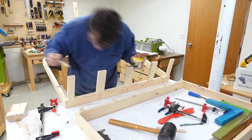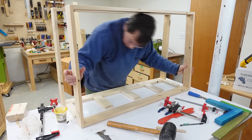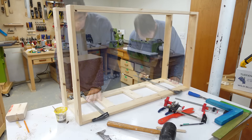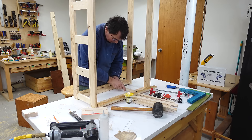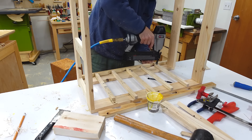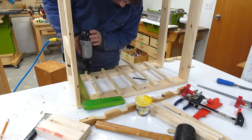There's still sawdust in that mortise and now I got glue in it too. Now it's another one of those times where I have to get a whole lot of mortise and tenon joints to line up all at once. With the frames now attached together I can start attaching the sticks to the insides — those will be the ones that'll hold up the blueberry boxes. Making sure everything is square before I put the second nail on each end of those little rails because that will end up locking the angle.